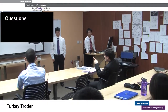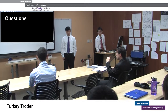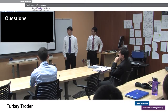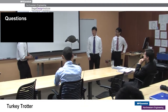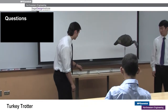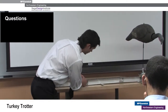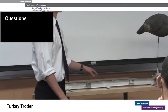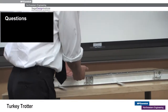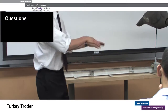I noticed on your demo that the track flexes a little bit — is that intentional? One feature recommendation we wanted was to make the track wider. The shortest cotter pins we could get stuck out a little too far, so the cotter pins on top would catch on the track. For this demonstration we left the top cotter pins out. In the future, this top plate would be wider so the cotter pins would fit and it wouldn't flex so much.